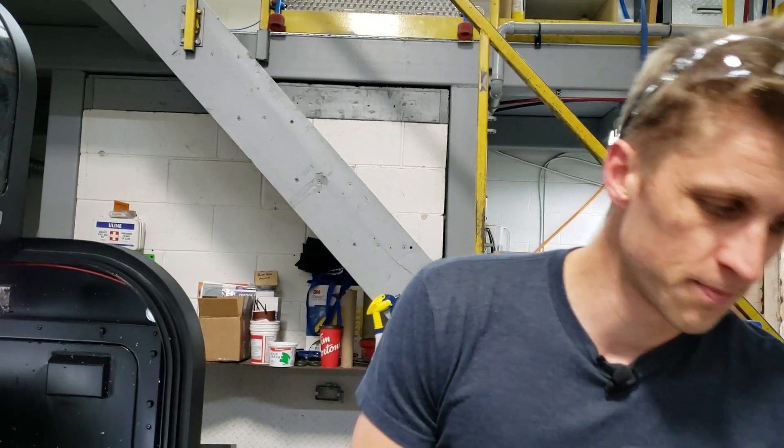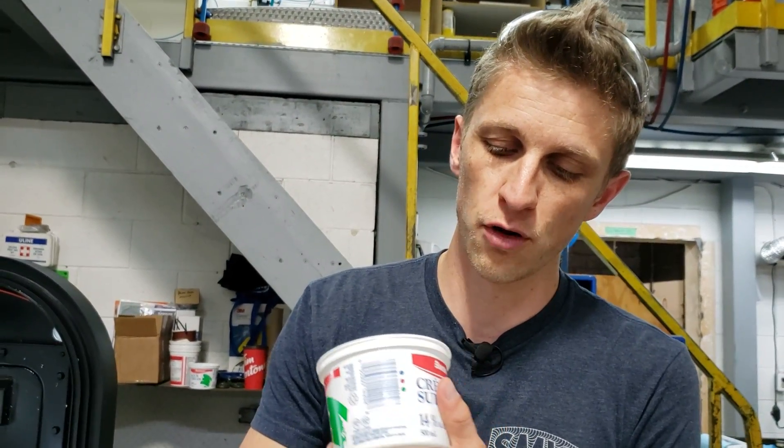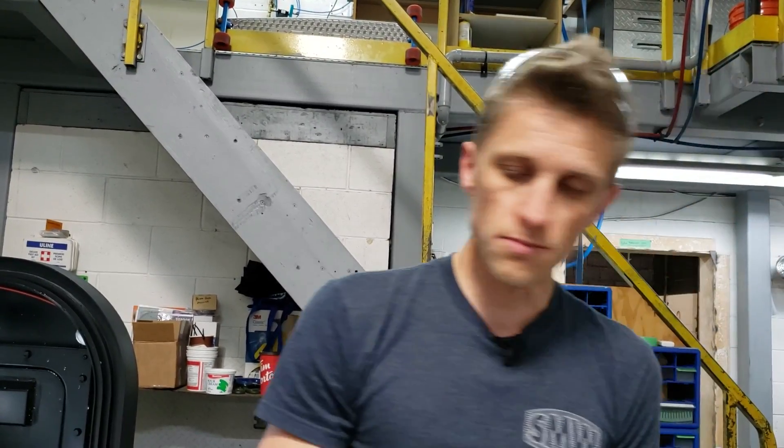I was able to make spacers. These little guys have a threaded 4-40 hole in the middle and they're beautiful on the outside. The cycle time was 51 seconds — they were over two minutes on the Nakamura, so more than twice as fast. We've run a couple hundred so far. Unfortunately we've got to switch to a different job because we're out of time. But the beauty of this machine is that it should have almost all of our tools set up all the time, so there'll be very little changeover — just some collets and maybe a drill to go from job to job.